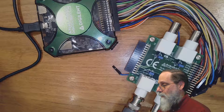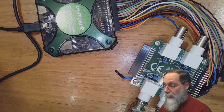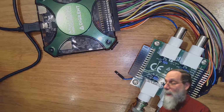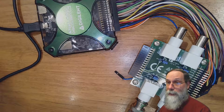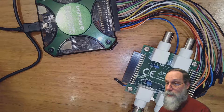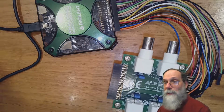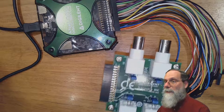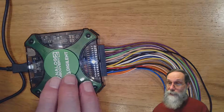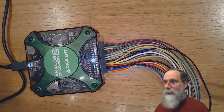And if you do that, then you can have some of the advantages of the oscilloscope probes, which is, say, you can go to higher frequencies, and you can have higher impedance on the probes if you switch to the times 10 probe. Now, the trouble with that is your voltage also gets switched down by a factor of 10, and that means you lose some of the resolution here. You need higher voltages in order for the Analog Discovery to see it, because the amplification in the Analog Discovery 2 is limited to a particular value, and if you stick a voltage divider in front of that that shrinks your voltage by a factor of 10, then you're going to need 10 times as much voltage to get the same signal visible. For what we're doing, which is mainly low frequency signals, these wires are perfectly adequate. We do not need to have the extra expense of the oscilloscope probes.